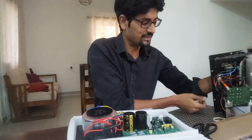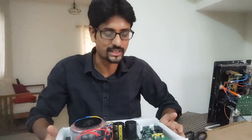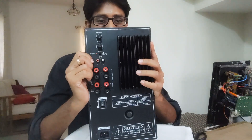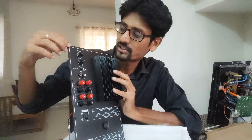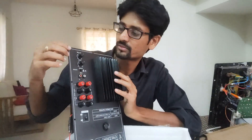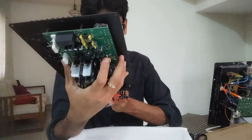You can see how this looks compared to a regular transformer. The board quality and soldering are very well made — professionally done. You can see a speaker relay as well, so it probably has a soft start. The heat sink is on this side. You can see the heat sinks and the connectors. There's a phase switch — 0 to 180 degrees — and a crossover from 0 to possibly 150 hertz. Then a volume control, good connectors, a mains on/off switch, and the AC switch. The toroidal transformer bolt is here.